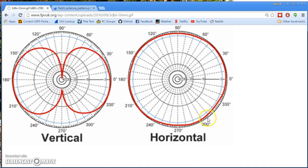This red line on the graph shows the relative strength of the signal at various locations around the antenna. Imagine the antenna was sitting in a field and you walked a fixed distance away, then walked a perfect circle around it - you would see variance in signal strength according to what this red line is doing. In the top-down view, the line is very nearly a circle, which is why we call this an omnidirectional antenna. It's not a perfect circle, but it's pretty close.